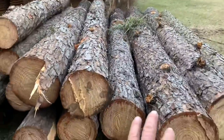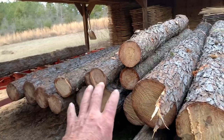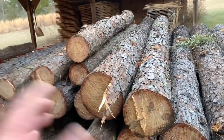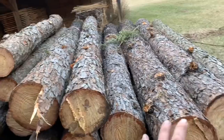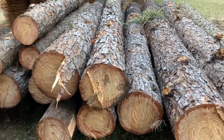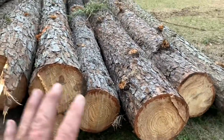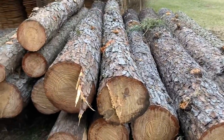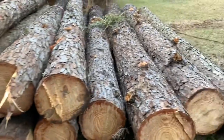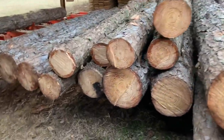16s are right here, and the top cuts off of these trees, a lot of these were 12s right here, smaller trees. I just cut them into 12s because I'm trying to get 2x10s, at least 2x10s, maybe 2x8s. I may have to go with 2x8s on some of these, especially that one down there at the bottom. I'm trying to regroup, because let me tell you, we used almost everything I had 16 feet long on that Kansas cabin.